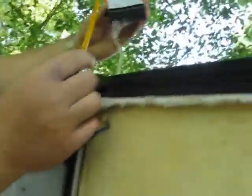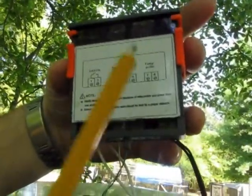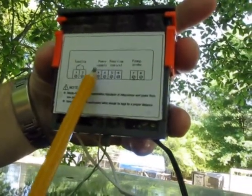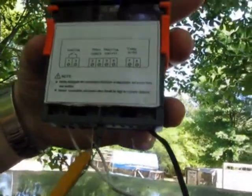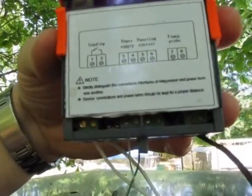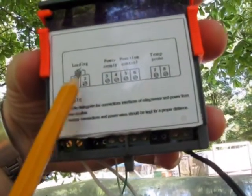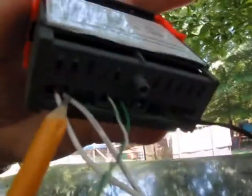Let's get right back to this right here — this is as complicated as this is. Temperature probe right here and it's out in the center of the box. Your power supply — it will say 'power input' or whatever your unit says — 110-volt or 240-volt if you're in Europe. On the diagram, you see this is your activation relay. This is what you've got to put in to activate your solid state relay, what you have to hook to go to your solid state relay. I'll be right back in just a minute with a little more detail.